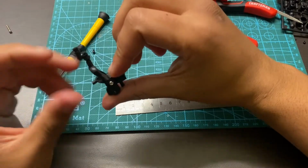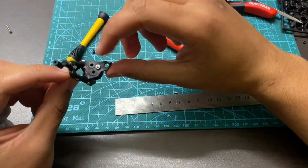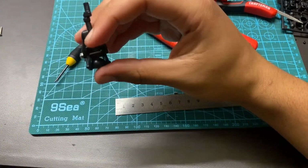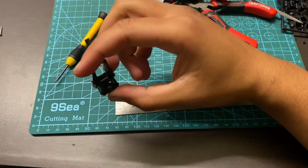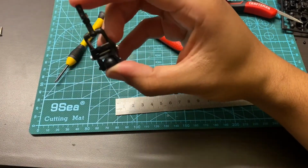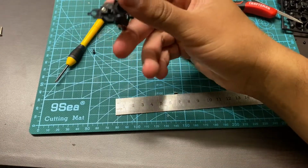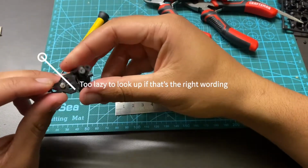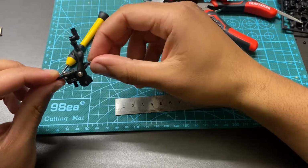This is the neck to the chest. So, excuse me. That's the thing I was telling you about. Some of the screws you're gonna need cut short. Make sure you get metal on metal, not plastic on metal, or else it will break. And make sure on this one, screw head goes underneath and the nut goes on top, just so you don't have that problem like I did.